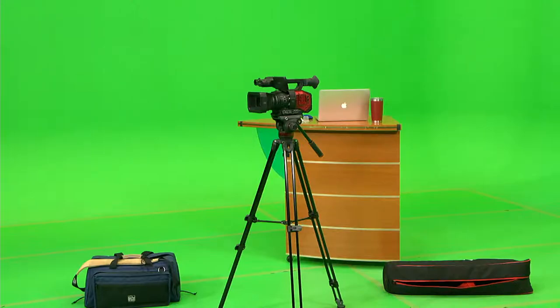You go over there at the union, and they have a speaker at the podium, and you got these audio boxes here in the back of the room. You plug in. Those are line levels, I know that. But here's the thing, you're gonna know. If you plug it in and you aren't sure, and you're getting this hot audio, and you turn it down and you can't get anything, then first thing you want to do is put that to line. If you're not getting anything, check that. Mic to mic, line to line.